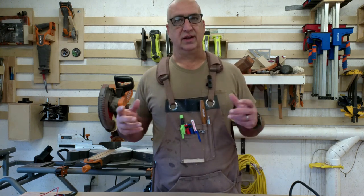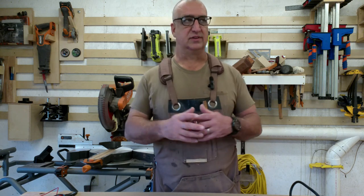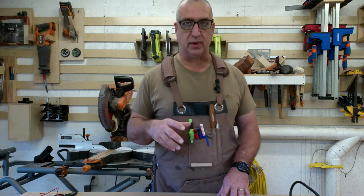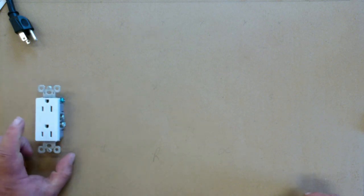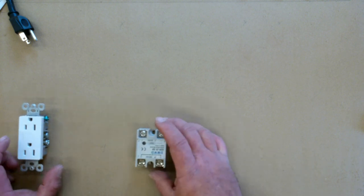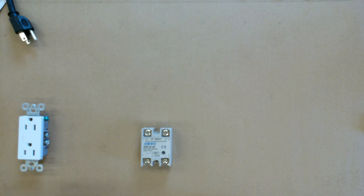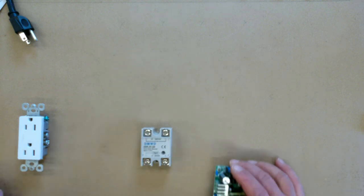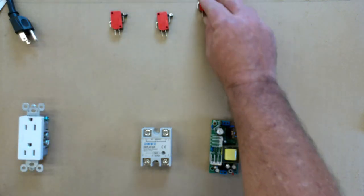When I first did mine, I didn't know if it was going to work. So I used about $10 worth of parts from things laying around my shop and it has worked for the last year and a half. But since there has been such an overwhelming response to that video, I went on Amazon and purchased a little higher-end switches and stuff, still very economical. So we've got our electrical outlet and a cord here that's going to plug in. We need this outlet to become charged when we want the system to work, and not charged when we don't. We're going to accomplish that by using this relay. So with this relay, we've got DC on the bottom and AC on the top. Now we need DC to get this to switch, so I've got an AC to DC converter that's going to give us the DC power. Then we're going to have these little switches right here.